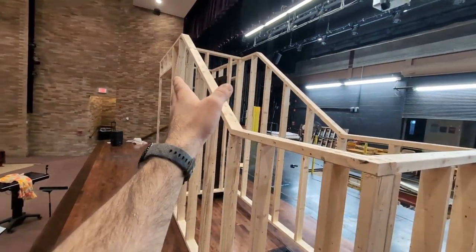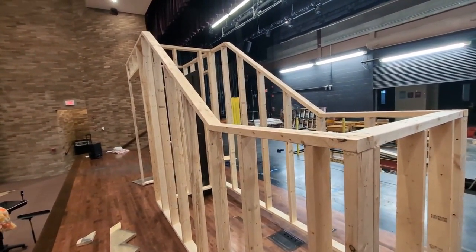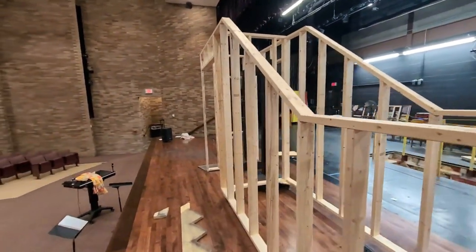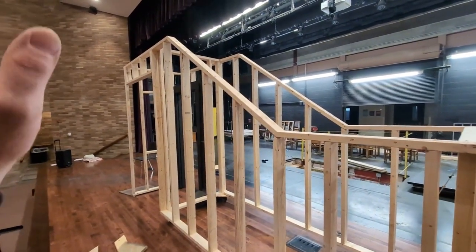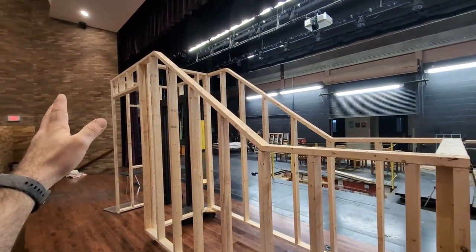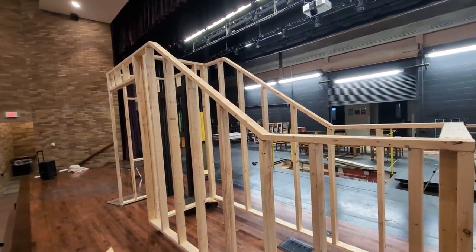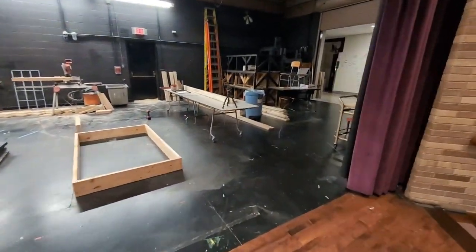So I can make the stairs wider because it's just a factor of scooting them out, and the treads can overhang 3/4 inch or 1/2 inch, and we'll still get the shadow line that we want. And I can still make the treads within, you know, 2 per 8-foot-long piece of lumber. And the upper landing, we're calling it, can be flush with the wall, because then the luan will stop there and it'll be exposed like it's the ceiling joist. Lots of questions here. You'll see more.